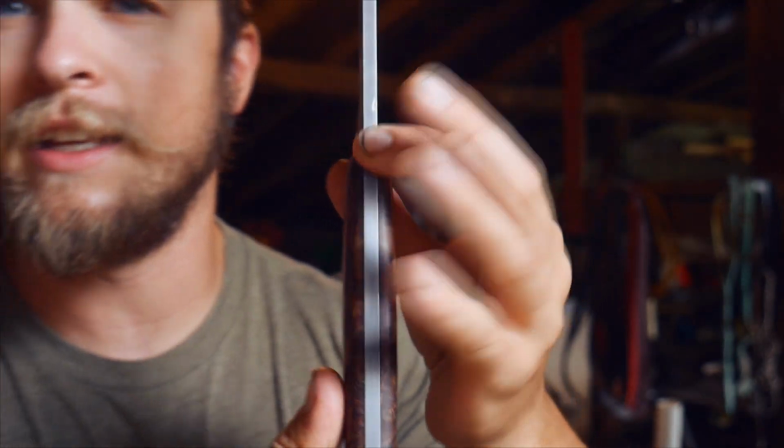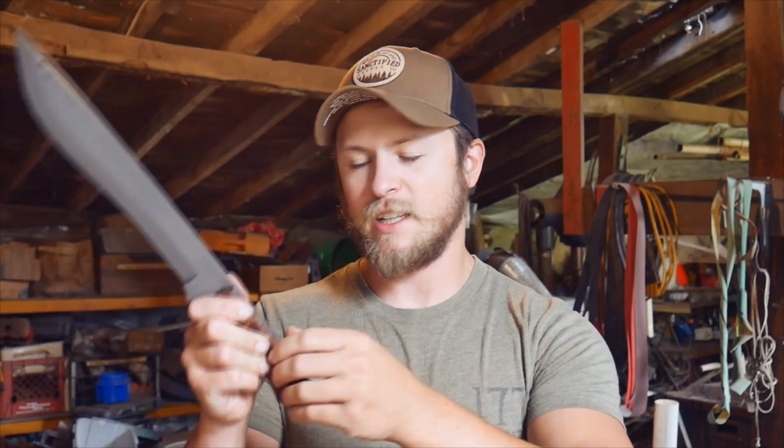And with that new technique I tried of a resisted etch, just assembling the whole thing at once and then protecting the blade from the ferric chloride, I think that makes a nicer finish, because usually there's a little ledge, because I can never seem to get everything to line up quite right. So I talked to some friends of mine and that's what they suggested to do, and it turned out fantastic. So really happy with the way it turned out.